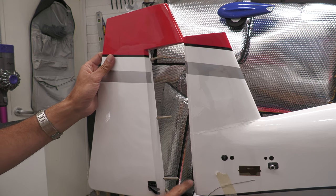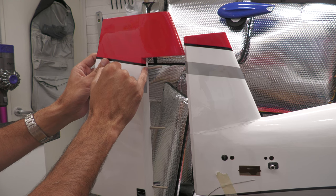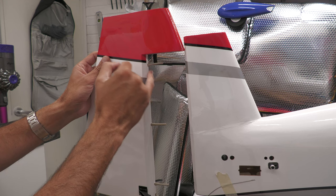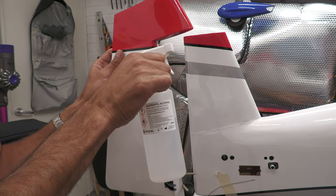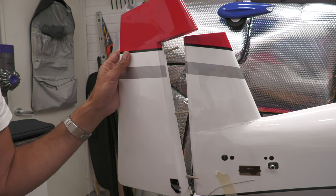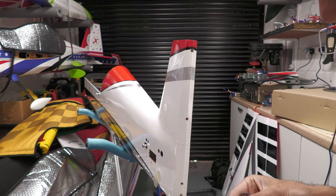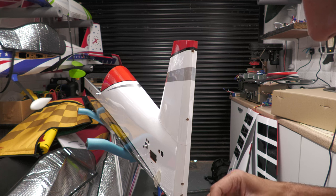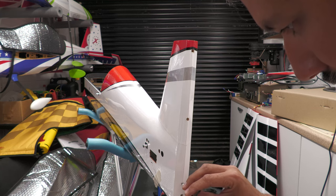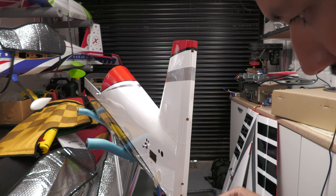Mine fits nicely now. I'm going to fill these holes with epoxy and put epoxy on the hinges, going about this far — not all the way to the top, because I don't want the epoxy to run back into the hinge itself. If I do get epoxy on the joint, I can use the alcohol spray and a bit of tissue to clean up any excess. I'm not worrying about getting epoxy on the covering — I'll clean that up afterwards.